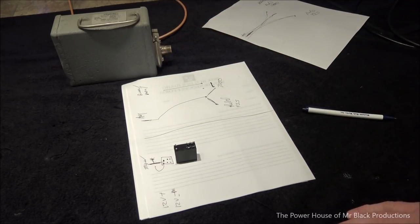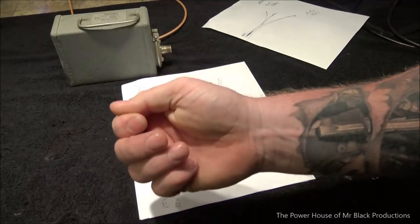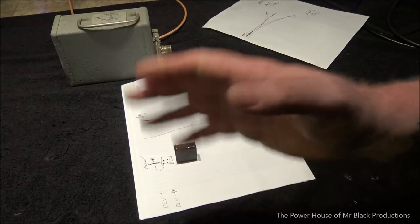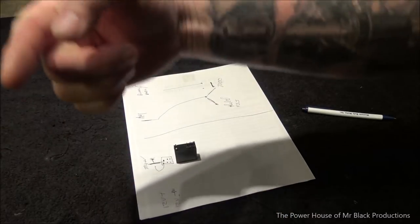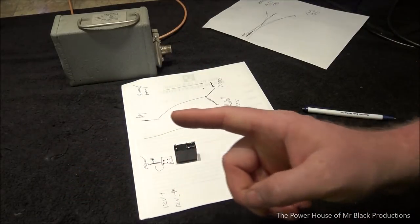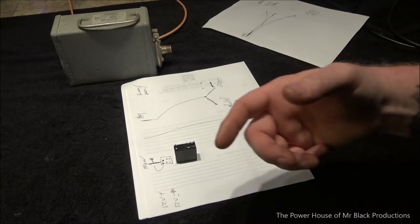You've got to remember that most of the Icoms and the Kenwoods and all the new radios have about a 10 to 20 millisecond delay from going into transmit mode. As soon as you fire down the key, you might think it's instant, but it's really not. There's a little bit of latency in there. Everything's shutting down, the radio's going into mute, it's killing off the VFO inside the radio, and then it's bringing on the transmitter side in its own time sequence. We're going to capitalize on that delay. That's the only way this works safely, and we're going to minimize the amount of time that it's present.